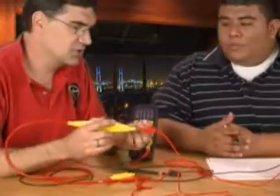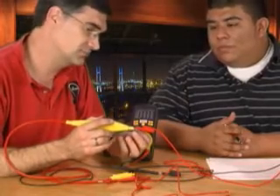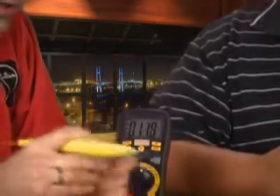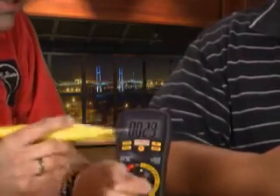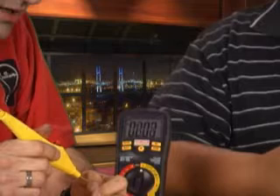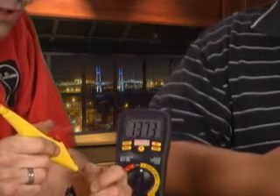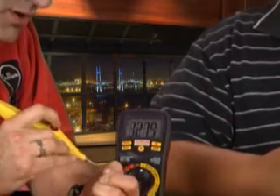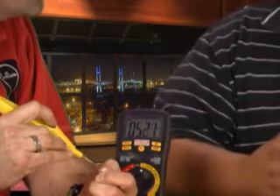But now watch — here's the resistance. This is 2,700 ohms. If I stick this in, notice I'll still read full system voltage through almost 25,000 ohms. But watch what happens when I load the circuit under these conditions — voltage falls on its butt.